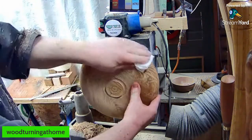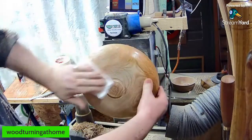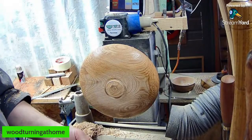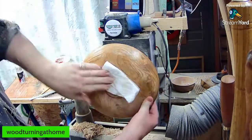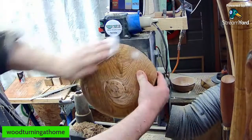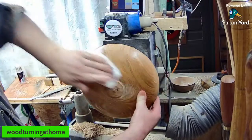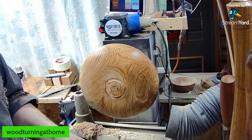Yeah, I think most people, apart from Terry himself, thin the Chestnut sanding sealer. I certainly would thin it as well. I use 60-40 though. This is it. Everybody's got their own mix.